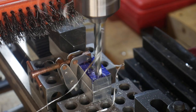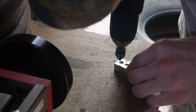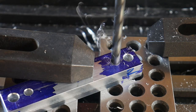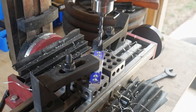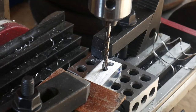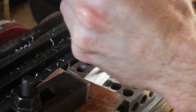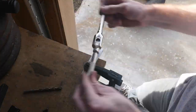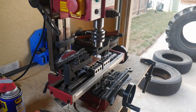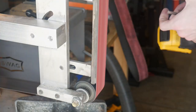Here I'm drilling the pin holes with the assembly clamped on top of 3-2-1 blocks, lined up so the bit passes through into a hole in the blocks. I used a countersink to clean up the holes, then enlarged the number-7 hole on the top jaw to match the pin-hole bit. On the bottom jaw I lined it up with a number-7 bit in the mill to confirm alignment, then started the tap in the mill chuck with the mill disengaged to get a nice straight tapped hole. I repeated this on both sides for two quarter-20 threaded holes.